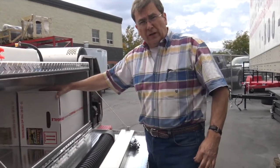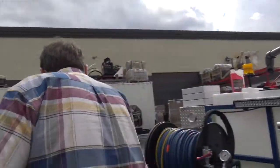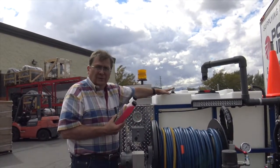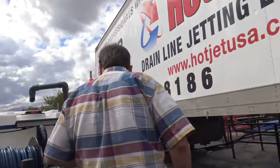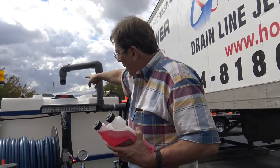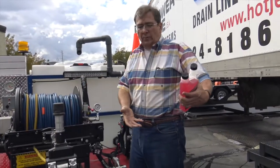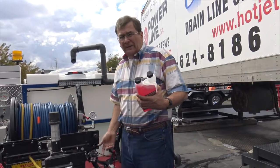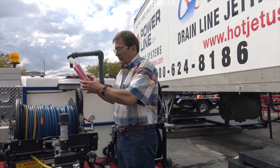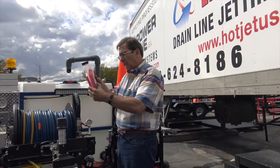Now I get asked a lot about our Jetter Juice. Jetter Juice, that's a good name. Our Total C. I know our units come with a soap tank, but I'll tell you, I prefer adding it to the tank. It's easier. The challenge with our soap valve, and we might phase it out for 2019, is by the time you open this up, it's got to go back through the pump into 496 feet of coil and then into 300 feet of hose. So boom, you're jetting, you got your soap coming out. You say, that's enough soap. You shut it off. You know, could be 5 minutes before it clears the line. So I really like adding this to the water tank. And generally anywhere from a half a bottle, which is 16 ounces, up to 32 ounces, which is a full bottle, full quart.